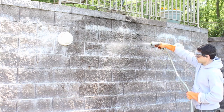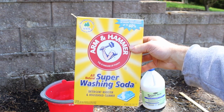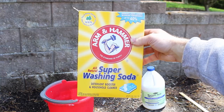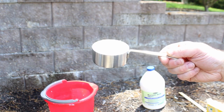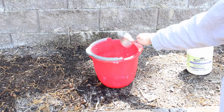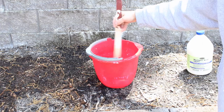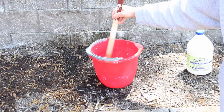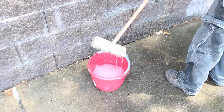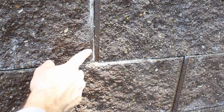Once you're done applying the acid, you need to rinse it off really well with water. I took one additional step to neutralize any remaining acid on the stone wall, and that was to add one half cup of baking soda to one gallon of water and stir it up really well using a wood stirrer — the same one I used for the acid. Then apply the baking soda solution to the wall with the scrub brush. This is just going to neutralize any remaining muriatic acid.